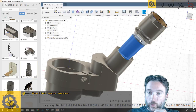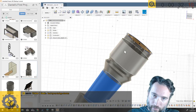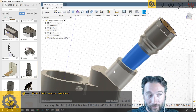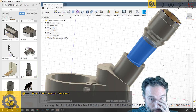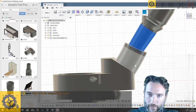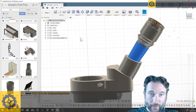So what I need to think about is exactly where. This ridge here allows this internal piece to rotate freely but be captured. So it's part of the print. Now, I've just realized as I think about this that I may struggle with this design if the intention is to print in one piece. I'm probably going to end up slicing this component into multiple pieces to print anyway. So I probably just need this to end in a surface that could be glued to this surface.